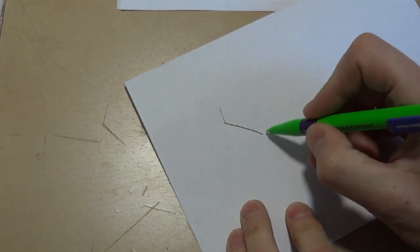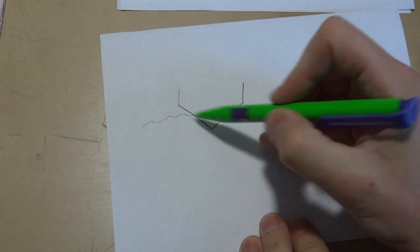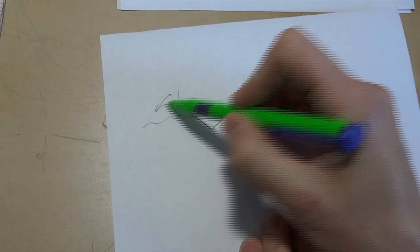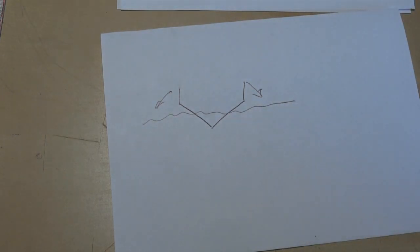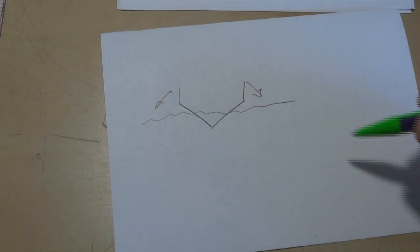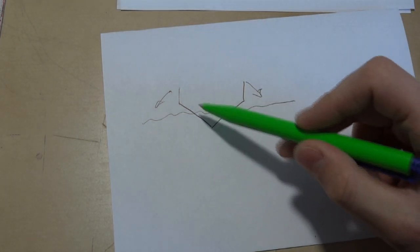So here's some further analysis of the boat. Obviously it was a bit unstable, and that was mainly due to the fact that the hull shape is quite pointy - there's a bit of an exaggeration. It felt like the waterline was roughly here, which meant it tipped sideways quite a lot. Basically that's just due to the hull design. When I was working on it, I concentrated on the fabrication technique of using expanded polystyrene, fleece and fibreglass. The boat was quite strong so I was happy with that part, but obviously I'm not the best boat designer, so it's a bit too pointy.